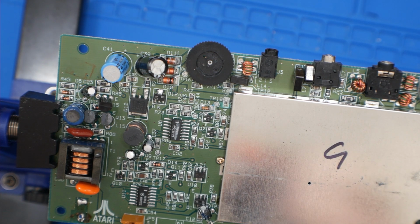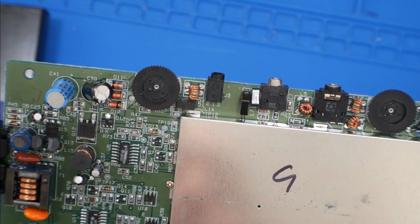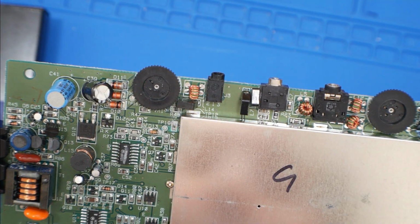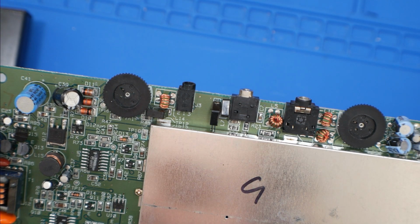But alright, we are going to prep by removing as much of the components as we can with our soldering iron. And then this big guy, because it has a huge ground plane on the bottom, is going to take a lot of heat, so that may have to be removed with hot air. But let's see. So, got my soldering iron.